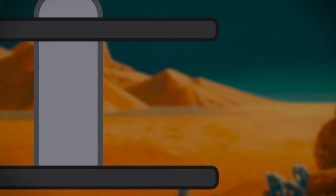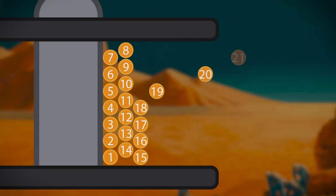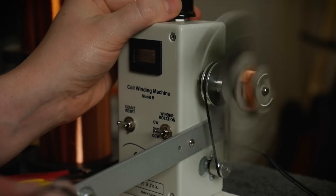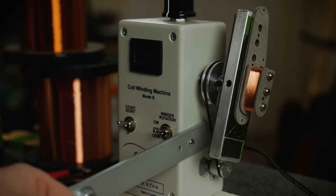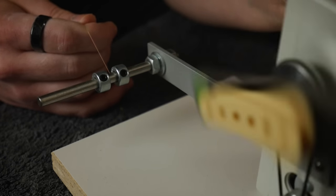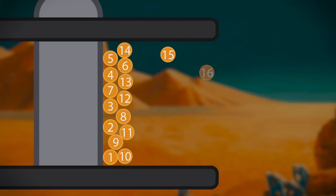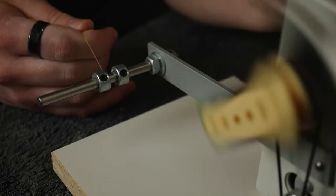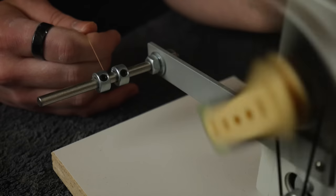Let's look at the cross section. We assumed before that the rows were all laid down neatly and perfectly, packing in the most uniform formation possible. This is only really physically achievable if the coil is wound by a computer-controlled machine that can feed the wire at a constant rate with a constant tension and has micron-perfect movements as it sweeps across the bobbin. However, most coils are wound by hand, by human operators, feeding the wire at inconsistent rates with inconsistent tension and with the layers not forming up in perfect uniform arrangement. They are scattered and distribute in depth, not in perfect layers, but in clumps here and there. Even the tightly packed hand-wound coil won't have perfect uniformity, and that once again changes the inductance of the coil. Machine wound pickups will sound different to hand wound pickups purely because of the human imperfections added into the system.